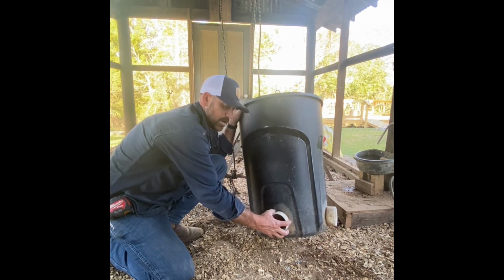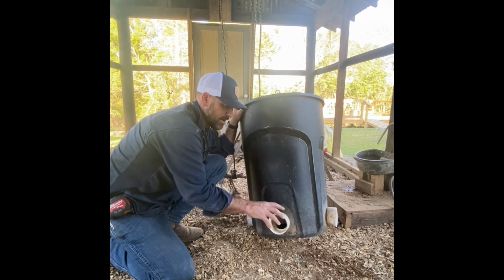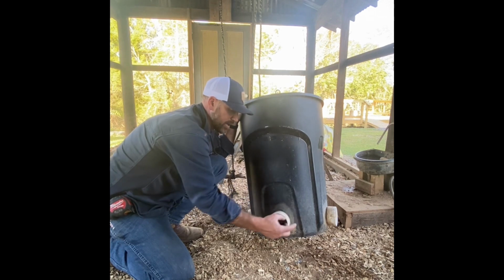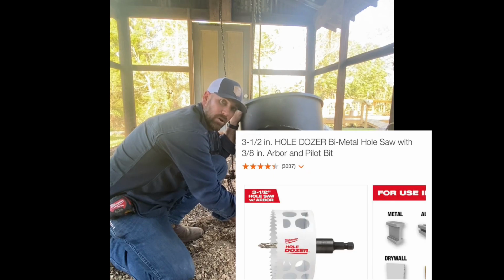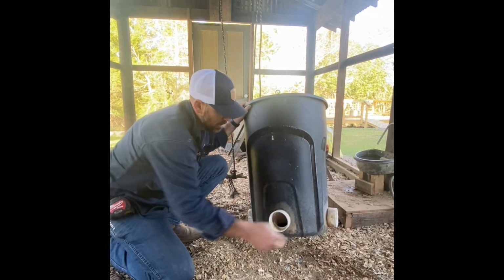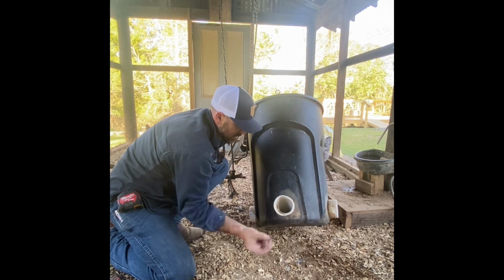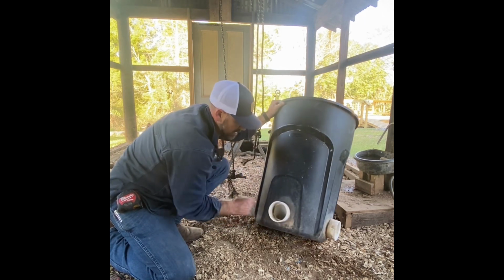So here we have a Street 90. It's a 3-inch Street 90. One side is flared, so if you bore a hole in it and slide this thing in here, this outer OD will be a little bit larger and hold for you. So you take a 3.5-inch hole saw, pop your hole 2 fingers from the bottom, and then drop your piece in there. The same thing for this one and this one.